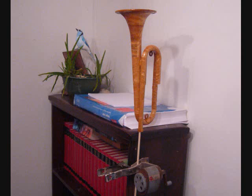The final steps are to clear coat everything. I like using Minwax polyurethane in the silver and gray can. It builds up quick and has a nice high gloss amber appearance. Sometimes I have to get creative with holding the instrument while it dries. I've put a dowel up through the lead pipe and clamped the dowel to the side of a bookcase. Extra humidity in the air can screw up a good finish, so the air should be ideally as dry as possible. I apply the finish with foam brushes.